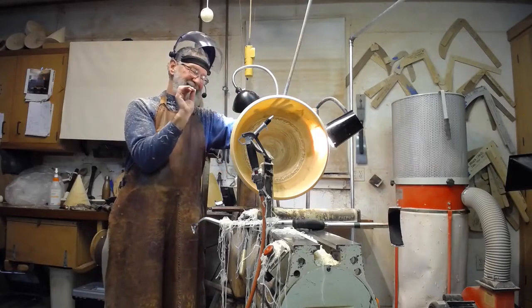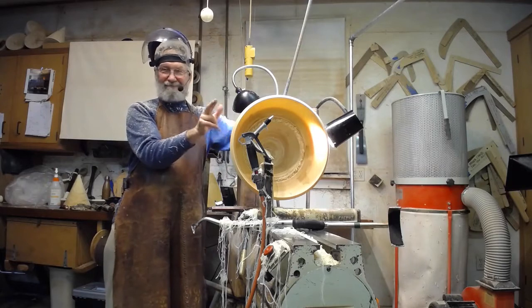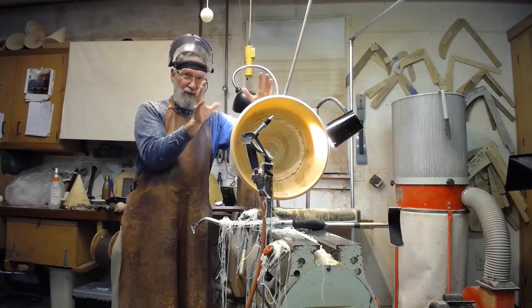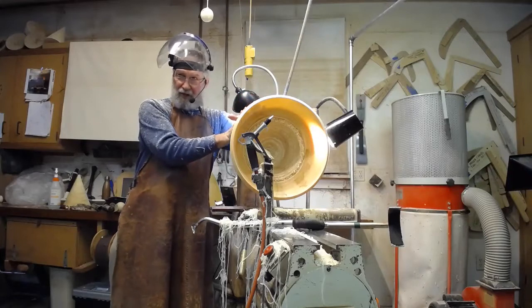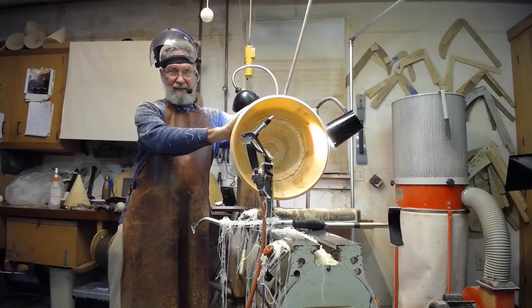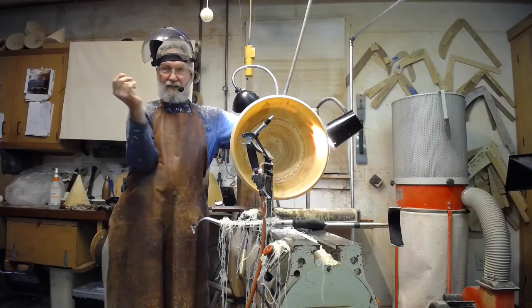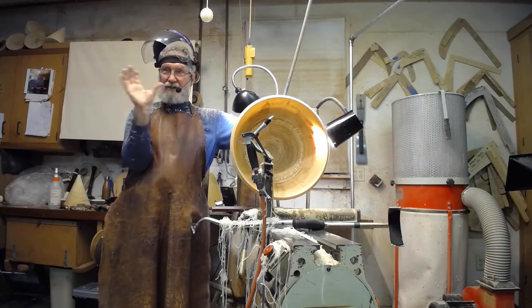So the proviso to that is that microscopically they will go out of round. Microscopically meaning just less than 1/100 of an inch, but on a 1/10 of an inch shade, if it shifts, say this isn't exactly a round log to start with, then it will go slightly out of round. Or if there's places that are wetter and drier, the drier parts have started to shrink and the wetter parts are still higher, bigger. Then when I'm sanding it, I'm more sanding those high points as it comes around, and I'll start to get some variation in the translucency because I've changed. It might be 1/100 of an inch over 1/10 of an inch on one part and 1/100 of an inch under. Well, that's enough to be a shift in the color.